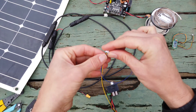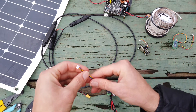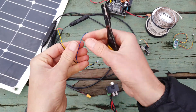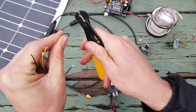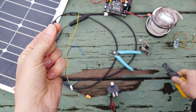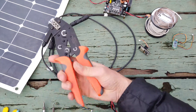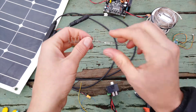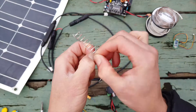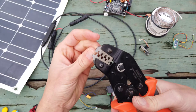I've got one that I've already cut. You can pull out the red — you don't need that, and in fact you will easily break your DPS supply if you use it. I'm going to cut them all the same length, take all three, and strip off a small 2mm segment from each. Wonderful. Now I'm going to take a crimp tool and connectorize the ends of those cables. So you need one, two, three JST pins and a connector block.